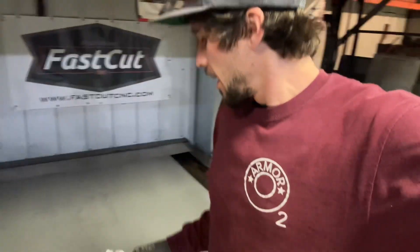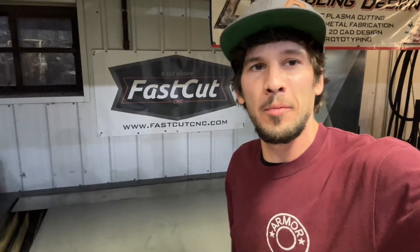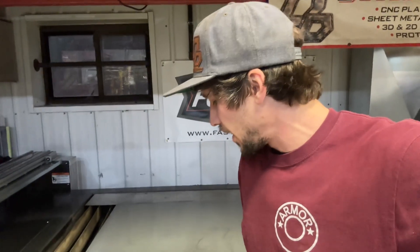One night I was playing with this. I cut a lot of aluminum with my fine cuts — and I know you're not supposed to, but I do it anyway because I really like the cut quality. I can take pieces off the table, 16 gauge aluminum, and it looks like a laser cut it. I don't have to wipe anything off the back, and I love it. But I was killing a lot of fine tip consumables.